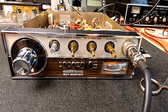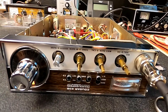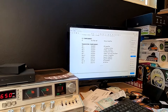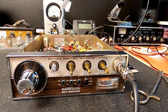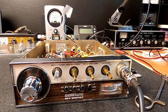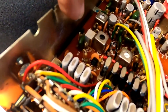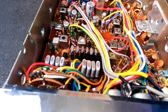So what I did is I went to the internet for a little bit of support. I was looking for a service manual, but all I could find was a user's manual. In that user's manual, it did give me some important information — that's kind of what old radios like this would do. They'd give you a block diagram, component listings, and what the voltages are supposed to be on any given part or transistor. So I checked TR2, 3, 4, and 5 — those are receiver mixers, 37 megahertz oscillators, a local oscillator, and a 455 kilohertz IF amplifier — these parts right here. You need to check these in-circuit.